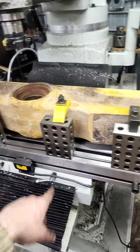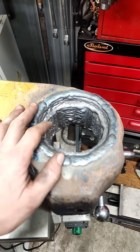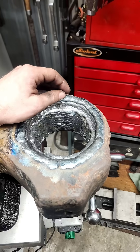The center is okay, it just needs a bushing change. The ends — I should have got a picture earlier — but they were completely pounded through the bushings. The center bore was actually almost out to the major diameter for the seals.